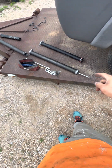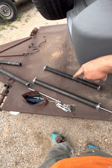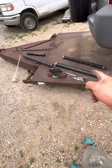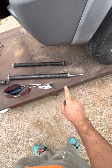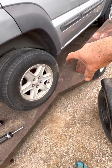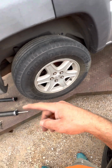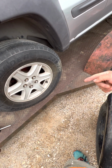Adjusted, I had to go back and actually go down from 31 to 29 because it was too much tension on these still, that it wasn't letting the garage door down all the way. And it worked out. So I ended up replacing both the right side and the left side of the garage doors. And so again, you go from down, up, and it'll be pretty obvious because if you take a picture before you take everything apart, those pulleys there, the rope comes up from the back side and wraps around, which means that if this is rotated this way, it's going to want to unravel this way. And it does that. As it does that, it's going to keep on winding that rope up.